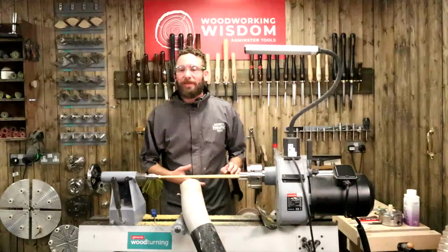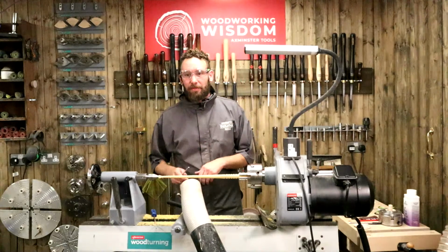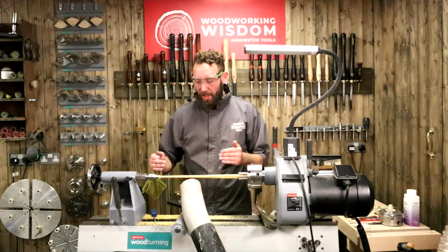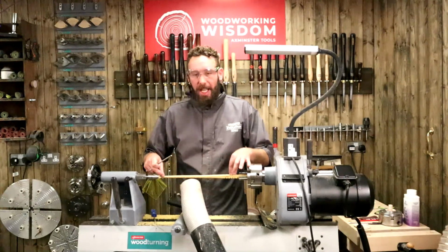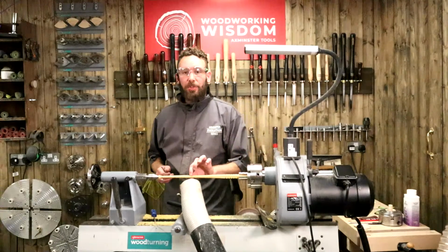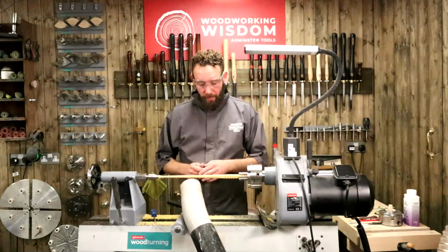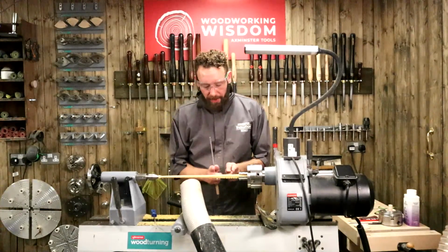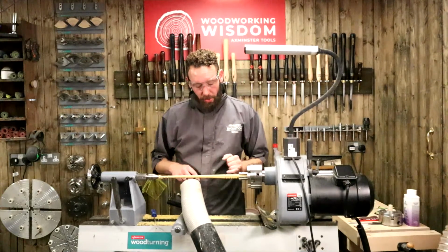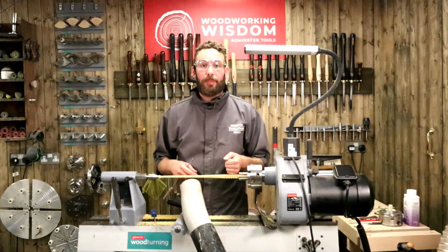Okay, so another question. Woodwork Learner here asked, does it have to be solid wood or could you laminate some? Yeah, you can laminate stuff. You could split it down the middle and have a two-tone thing going on. Quite often it's quite nice to use the sapwood, so you get that difference in color. Just be a bit careful if you're gluing them that way. You need to make sure that they're properly fixed, so you might need to glue and dowel them.